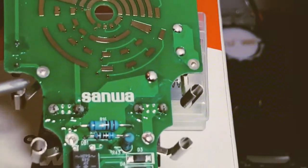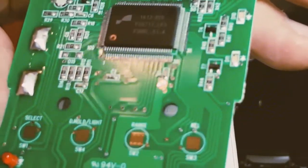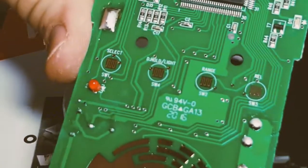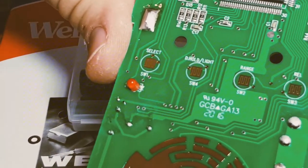Once again, the connectors are just soldered on. So there you have it, the inner workings, and of course the knob selectors for the push button selecting switch. Another good preventative maintenance tip is, if you're going to clean the display, do the same thing here with some isopropyl alcohol. Sometimes people have a lack of response with their push buttons after a couple of years, so just cleaning these selectors right on the PCB with alcohol can help you from having that problem.